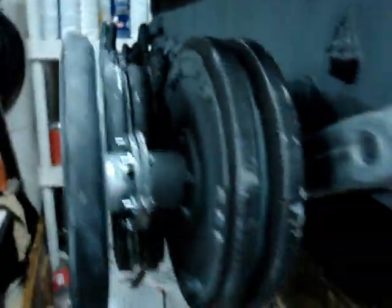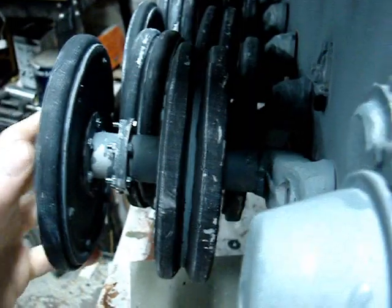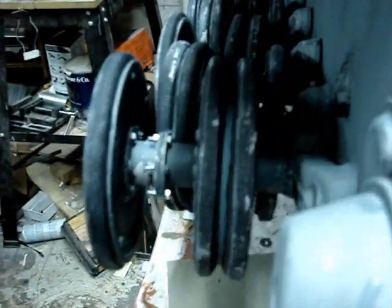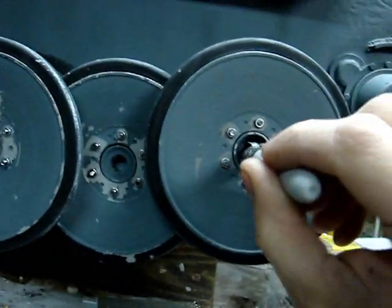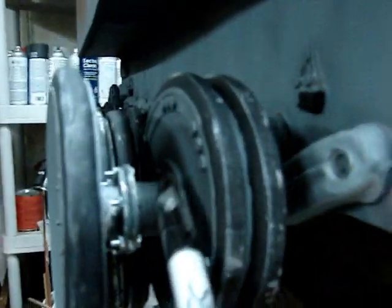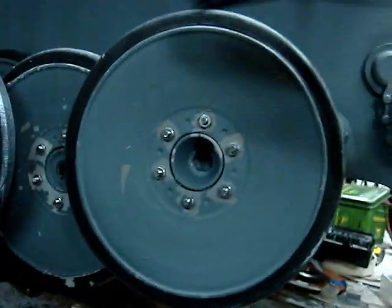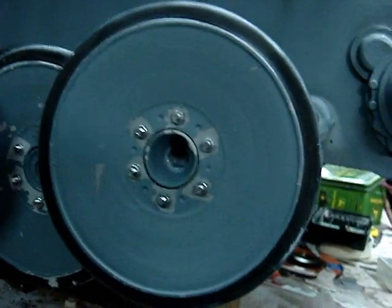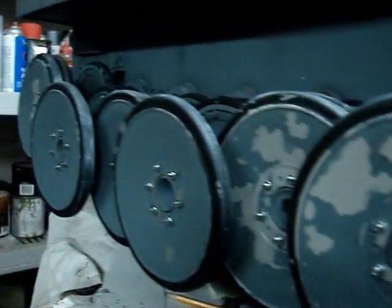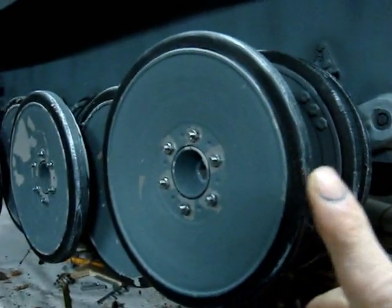When I was designing the wheel system, I wanted to make the wheels as realistic as possible. I designed the wheels to all be assembled as if they were on the real one — they're assembled via bolt construction with no glues or adhesives, only fasteners. The wheels mount to the vehicle via a hidden bolt underneath the torsion bar detail cap. The bolt is on the inside and threads directly into the torsion bar, and is completely covered up by the bolt-face detailing on the wheel itself.